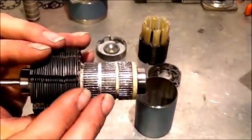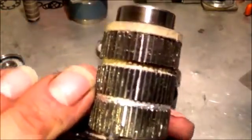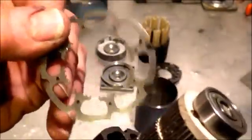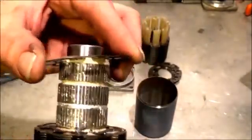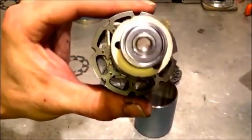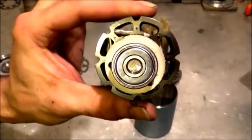In these little grooves, like I showed in the original Tesla turbine build from the other stator motor, I have to build keeper pins that'll fit. These grooves have a recess in them, so you're going to build a little pin that slides down into that recess, lining up with the inner teeth on this ring. Those inner teeth will line up perfectly, you put a little keeper pin in on two sides, slide those down over the keeper pin, and that'll lock it so it doesn't spin against the inner rotor. You can now see down those holes and the blades are perfectly lined with each other — right through it, more like Tesla's original turbine design.